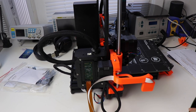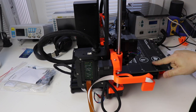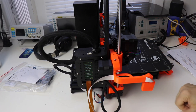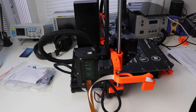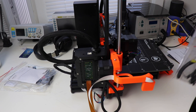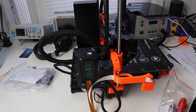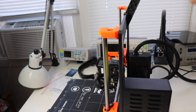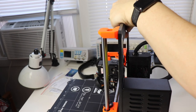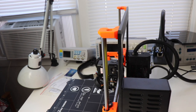In this step we're going to be disassembling the extruder. I needed to make sure the filament was unloaded, the steel sheet was removed, and the power was unplugged before I started. The printer comes with all the tools necessary and does come with many of them, but I found a pair of flush cutters helps with releasing the zip ties. You just got to be careful that you don't clip any of the wires. I'm going to start by removing the filament holder because we won't need this anymore.